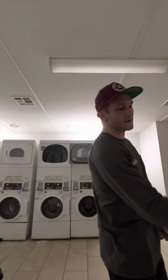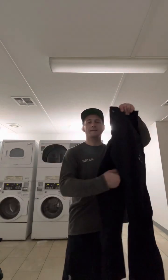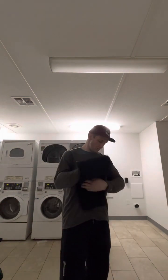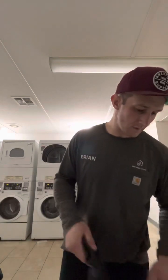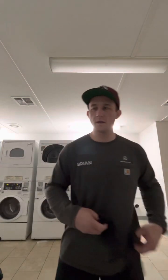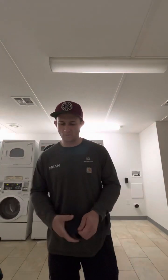Number one, when you're looking for a generator, if you can see this video early enough and you're building your food truck, if you can get propane appliances, get propane rather than electric, especially for heating. Anything that creates heat: oven, warmers, coffee makers, a hot water heater. Heat and motors, like a condenser on an AC, are the biggest power consumptions. They drain that generator.